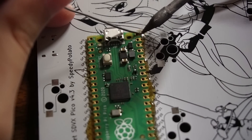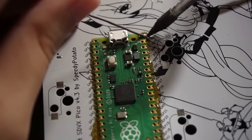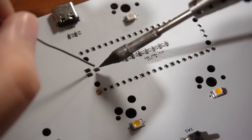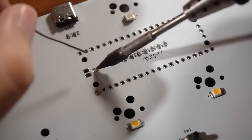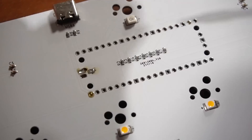After that, I added more solder to the top to solder the pin to the board. Next, flip the board over and add solder to those three through-hole pads. You should wiggle your soldering iron a little here so that the solder properly goes through the hole and solders the Pico on the other side. I accidentally added too much solder, so I desoldered it with my solder sucker and tried again. Repeat the same step for the rest of the through-hole pads.